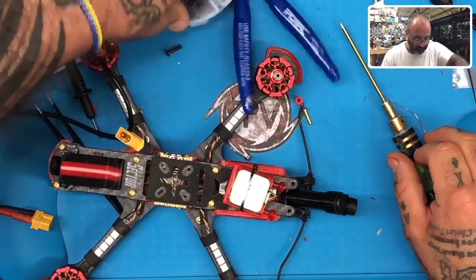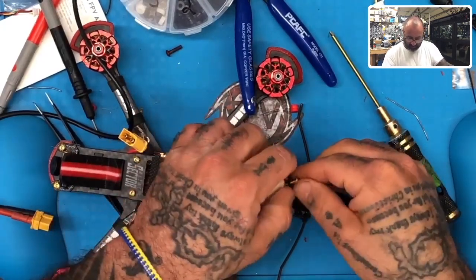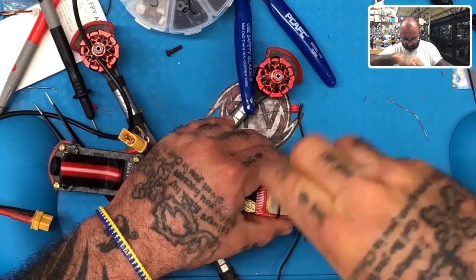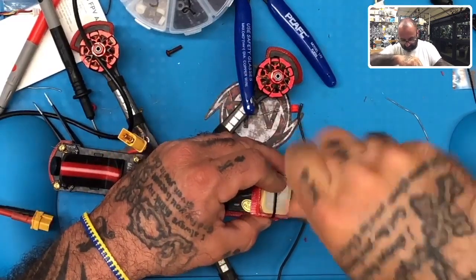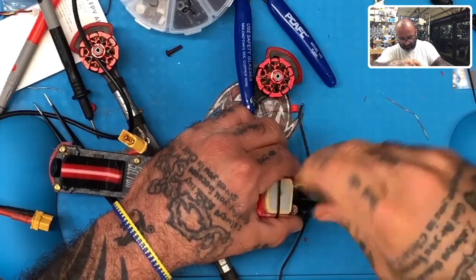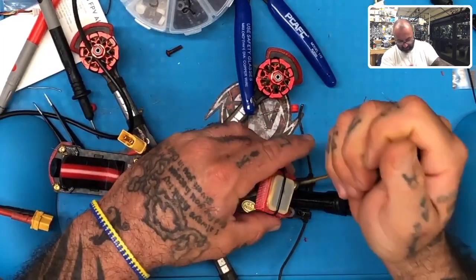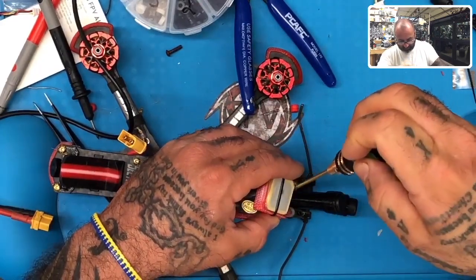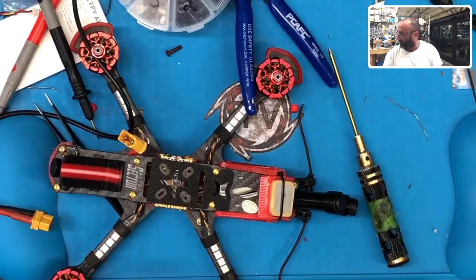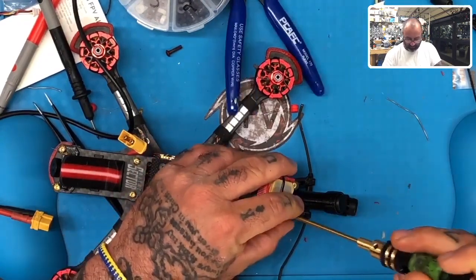And actually, I'm going to take a 1 mil because I don't want to crank into the TPU because that can usually weaken it. So I'm going to put the washer on top. I'm going to put the screw, I'm going to put this on here so I can just drive this in. And then let's see what we end up with, because I think this is going to come out pretty good. There we go. Yeah, that came out nice. Definitely fit well. I think it's going to be a great fit. Actually, let me just loosen this up because I didn't put the other one on yet, and I want to make sure that these fit straight. I'd say this overall thing came out pretty nice. You know, I mean, it looks good. We'll be testing it here in just a second, but overall, I'm pretty impressed with that.